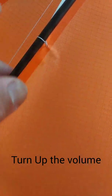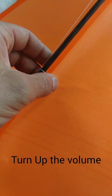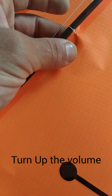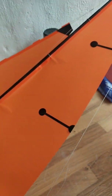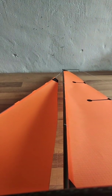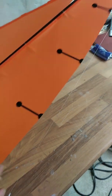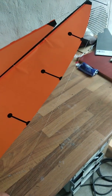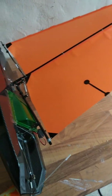Another thing we have to change is the tension for these knots. As you can see, there are some wrinkles, and the reason is the sail can't move freely around the mast — which is not good. We have to remake these loops with a little more space between mast and sail. The mast itself is pretty straight, slightly bent forward by the manufacturing process, but it can be adjusted by the backstay. The creases increase as you can see right here.